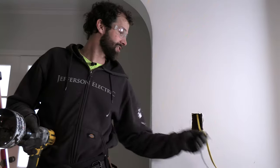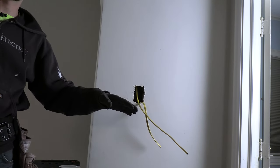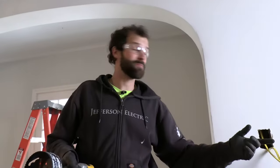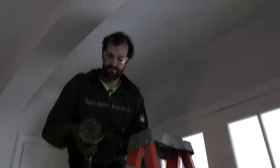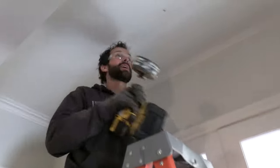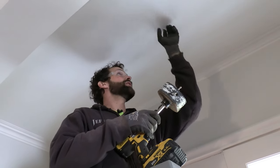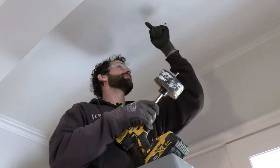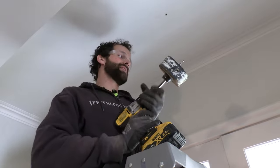I'm not going to make the mistake of cutting the wire up here before I've double-checked that I have enough in my switch below. I'm going to go down, drill my hole up, then come back up and finalize the can light, put the boards back, and the rest of the work takes place down below. Here's the wire successfully fished down the wall and out of our switch box. Now our switch is ready to be made up.